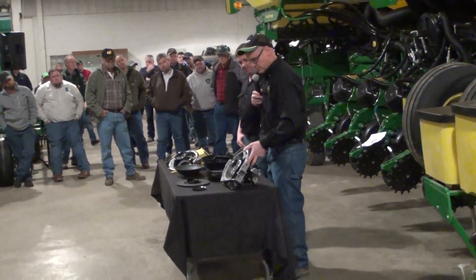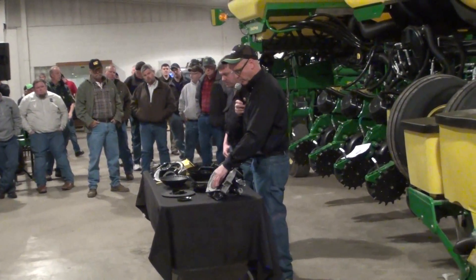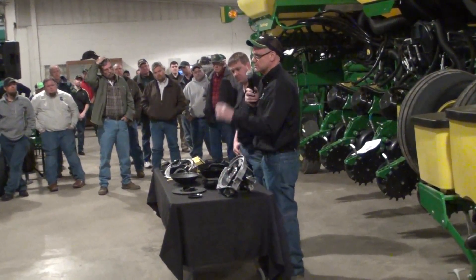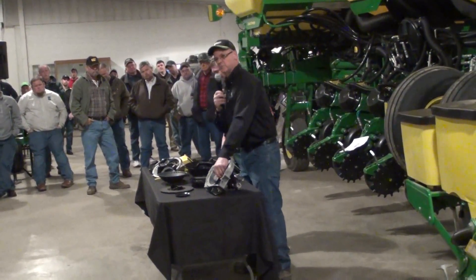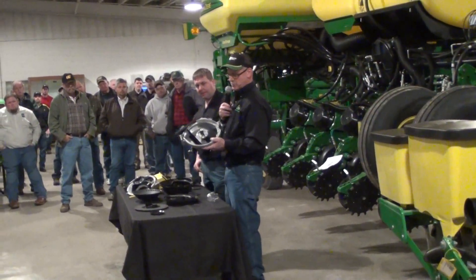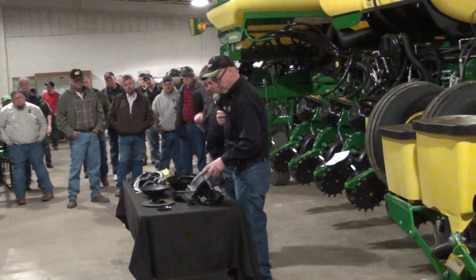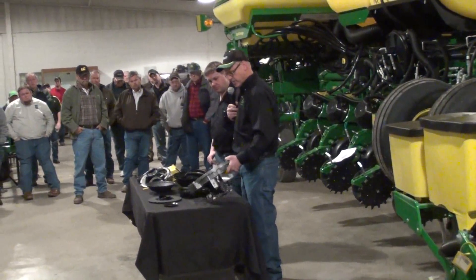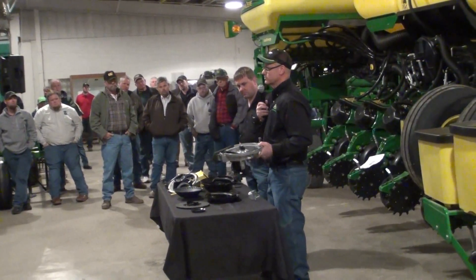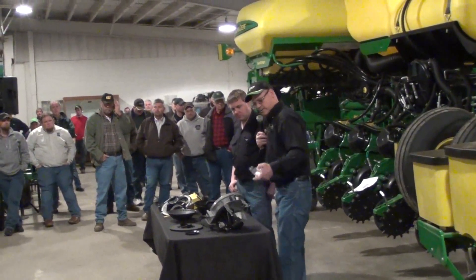Inside the meter it's fairly simple — it's got one brush. You can snap that out very easily. You just want to look at it and make sure the bristles are good. If they start seeing thin spots, like hair getting thin, it's time to replace that brush. Just pull it out, stick a new one back in. Keep in mind there is a notch on one end of the brush, and you want to make sure you get that notch packed the same way. Inside there's also a baffle designed for different crops, but for corn and beans it's always in the same spot.